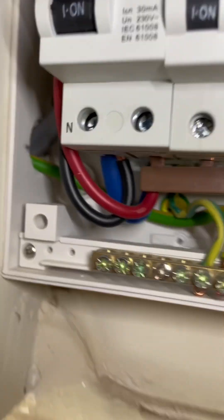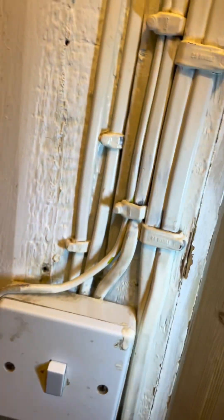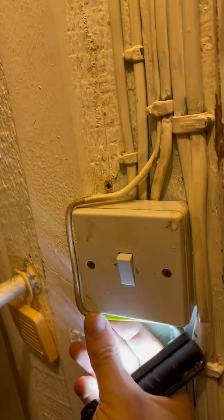That set of insulated and sheathed cables coming off the load side of the RCD comes into this cabinet, goes back out and goes along this trunking and into that DB in there - upside down and inside out, with all the cable support out of the bottom of this socket. Under polarity I'll put incorrect there. Check out that bond - that's the earth protective bonding conductor. There are so many issues with this place, so many issues. We're going to be spending more time typing it up than actually testing.